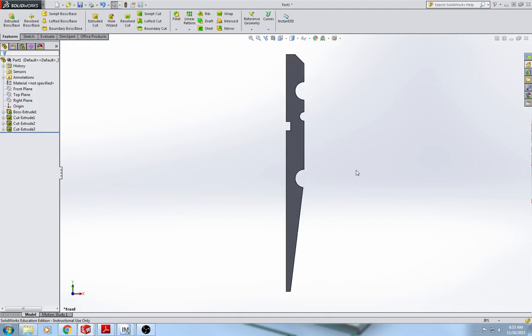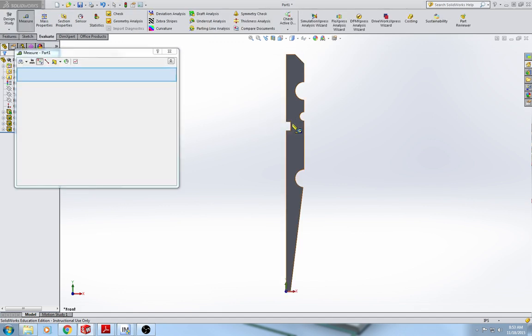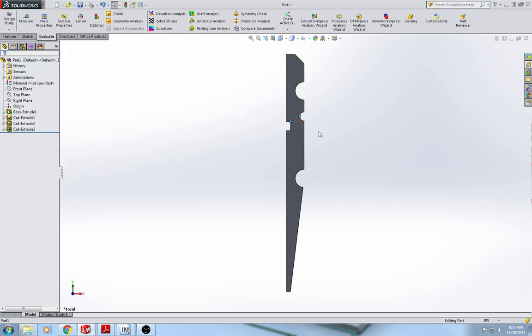Okay, and then now what we're going to do is we are going to put in our initials. Now, if you look at this and you notice that your arc is really, really close to this, let's say any closer than an eighth of an inch, then what you're probably going to need to do is make this arc smaller, since that arc's not critical to the functionality of the clothespin. You could actually completely get rid of it if it's too close to your notch over here.